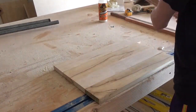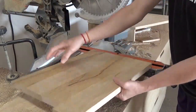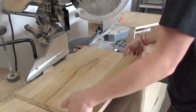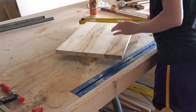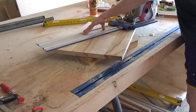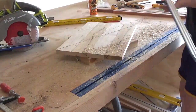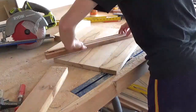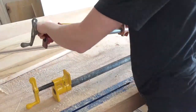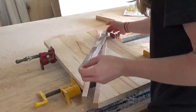I took a chance and thought it looked kind of decent, so I went ahead and started cutting. I trimmed the ends of the maple board nice and flush, then used a straight edge to draw the line across one diagonal. I used my Kreg AccuCut and circular saw to cut along this line. Then I placed my walnut and cherry boards in the diagonal so that the walnut was sandwiched between the cherry and glued it up. The biggest thing to make sure of when gluing this up is that you keep the maple boards lined up straight.